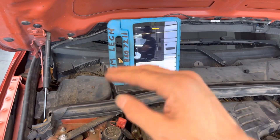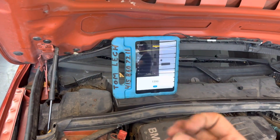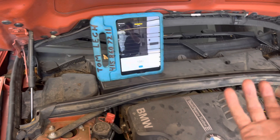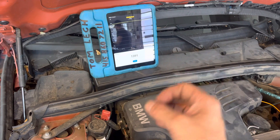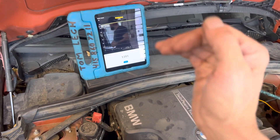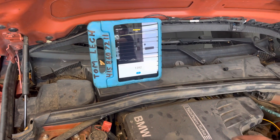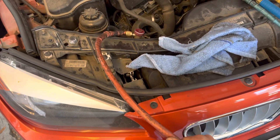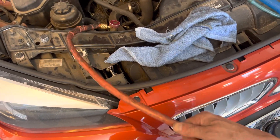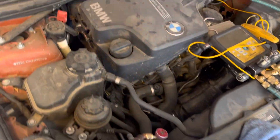Every time you try to do that, it will take longer and longer to get smaller and smaller improvements. It's not linear — it's kind of exponential, on a bell curve. The performance to achieve a lower number takes much more work. It becomes really difficult to get really low numbers; you really have to go a lot of hours to get down there. You are always limited by your refrigerant hoses — if you're trying to use a micron gauge testing through your hoses, you can never hold lower than the limitation of your refrigerant hoses.